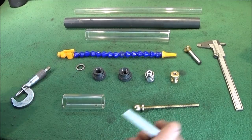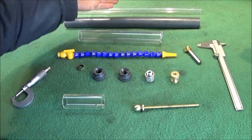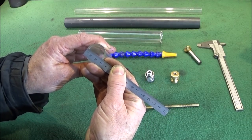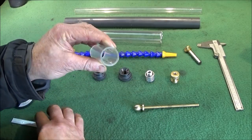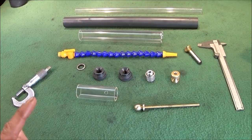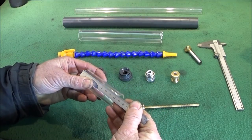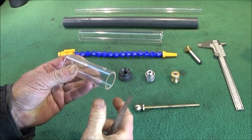On the bench it's all very straightforward. I bought some polycarbonate tubing which you can get on eBay in various diameters and wall thicknesses. I bought 30mm external diameter and 25mm internal diameter, so it has a nice small wall thickness and it's very strong. I cut mine to about 84mm long and put it in the lathe to square the ends up.